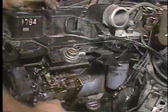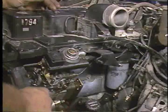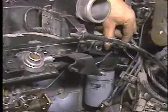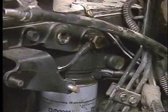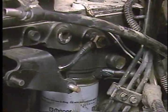Next, reinstall and tighten the fuel drain manifold line hold-down clamp bolt. Now, reinstall the fuel supply line to the pump and securely tighten the fitting. Install the other end of the supply line to the separator filter using the new provided sealing washers.